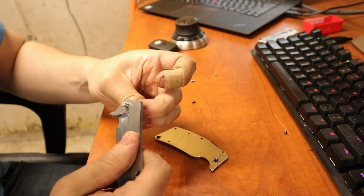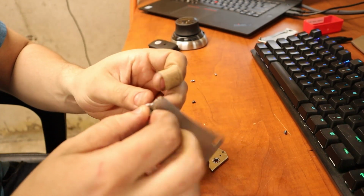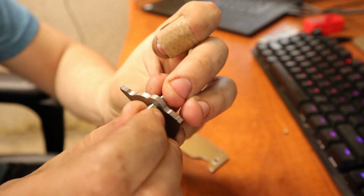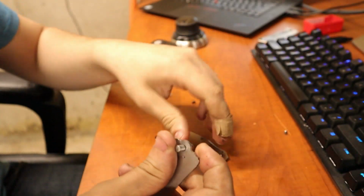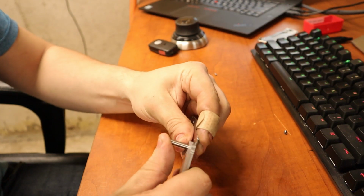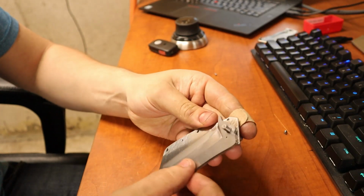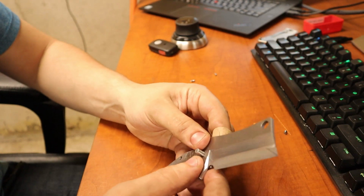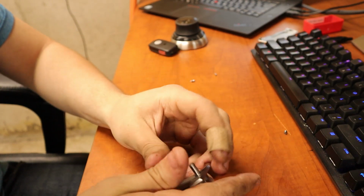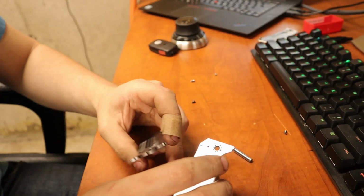And it's pretty strange because there's obviously no resistance when you put a dowel pin through the blade. And there's no side-to-side movement. It's pretty tight tolerance on there. So when you put this together like so, without the pivot that I'm using, it slides together really good. Obviously there's no pressure, there's no hardware holding the two handles together. And so I was like, I don't really know what I'm doing wrong. Maybe I'm just not cut out for knife making.